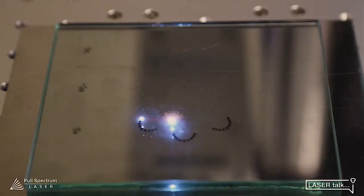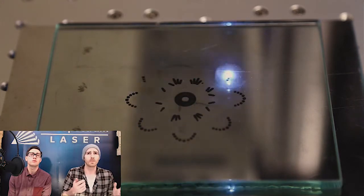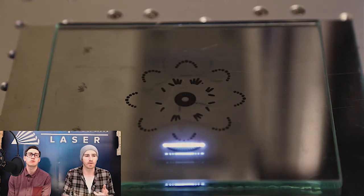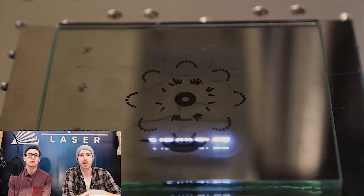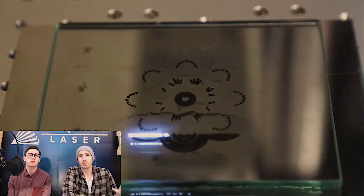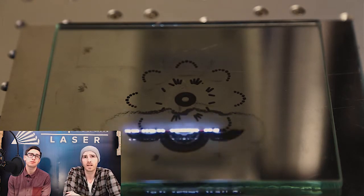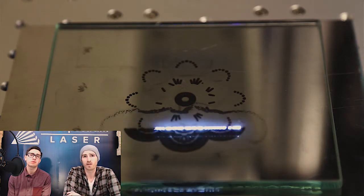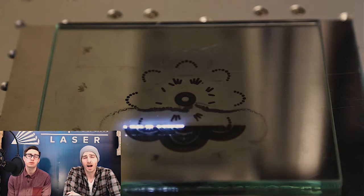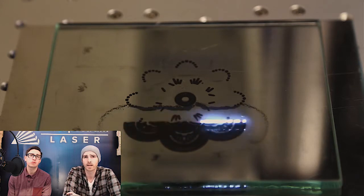So if you want, Charles, let's just roll the video of the process happening and we can take a look. It's pretty cool. Now, this was done on our open system, our FD fiber system. What's great about these FD systems, if you're just going to start a business with a fiber and all you're going to do is engrave tumblers or other tchotchkes that you would otherwise be getting like a 36 or a Pro 48 for, you could do a whole bunch of them. Consider looking at a fiber laser system, mostly because you can see the speed that the engraving happens is astronomical. It's about a 4-to-1 ratio for speed, and then quality is just through the roof. The accuracy of the fiber laser far surpasses that of the CO2.